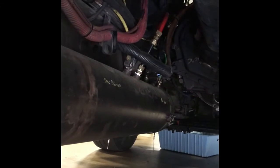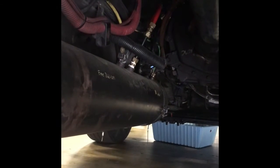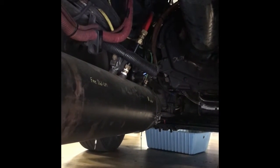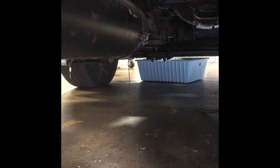Once the truck is shut off, it releases all the pressure from the air dryer, and that water should trickle down into the wet tank. And then there's a drain. If you see that pull chain hanging, there's a drain on it so that you can drain out that water. So you release your air pressure and you just let the water flow until it's dry.